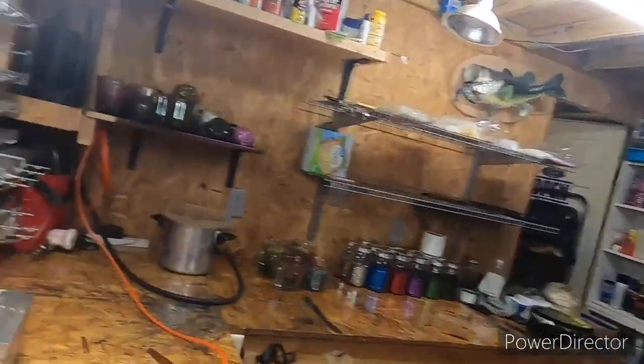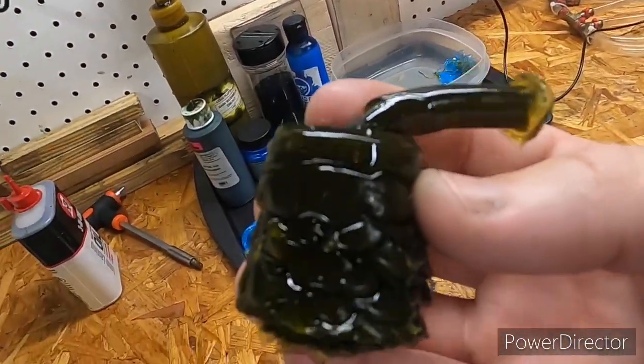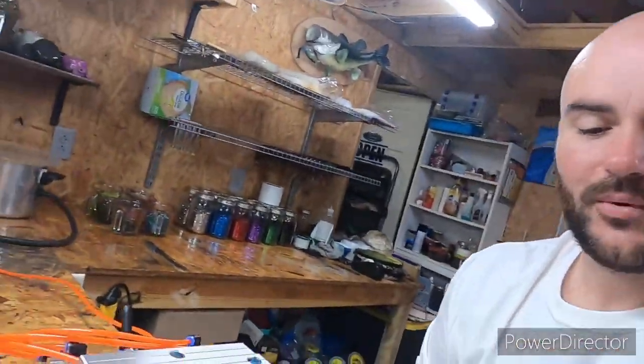And you can see right here, if we would have had it a little bit hotter, we probably could have filled that mold, but that mold right there didn't even come nowhere near having enough. But anyway, that goes back to operator error. That was all on me there. When you're shooting that many molds, it would have either been a good idea to heat the injector up a little bit, or actually heat the molds.